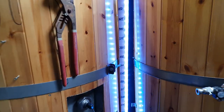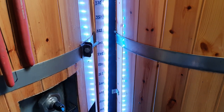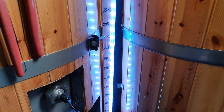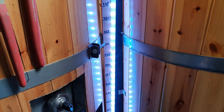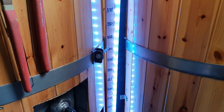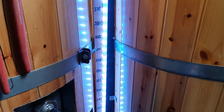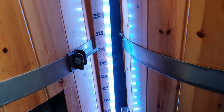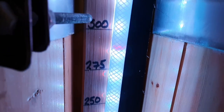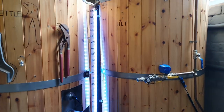I did change out the LED strip for the HLT and it turns out this one isn't a white light, it's an RGB. So I've just bridged out the terminals — you've got 12 volts in and then you've got the three other negative legs across blue, green and red, and this seems to be slightly blue biased. But we can see the little flotation device in there I use to indicate the height, so that's fine.